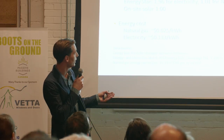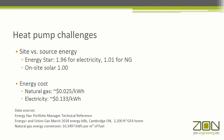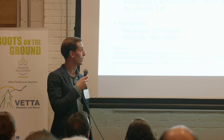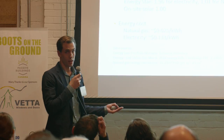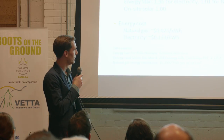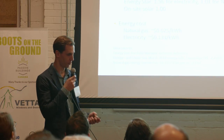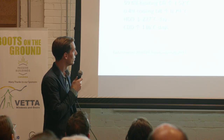Some challenges with heat pumps — site versus source factors come into play. This is Energy Star's latest numbers from February 2018: Canada-wide, we're at 1.96 for electricity, 1.01 for natural gas. But if you know that over the course of a heating season, if we have a COP that doesn't really go below 2, we're still kind of coming out ahead. And if we have on-site generation, that comes off the top anyway. The challenge with heating with electricity versus gas is — this is for a typical Cambridge home on recent bills — the cost is about 5 to 1 per unit of energy, so it's hard to ignore.